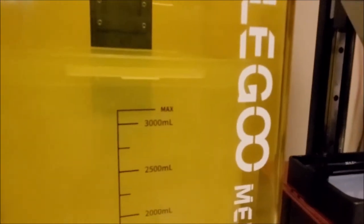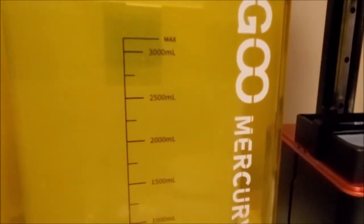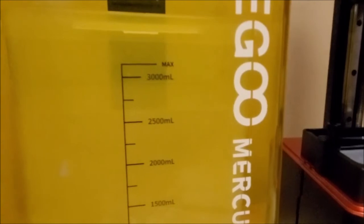So we'll let this drip, and then I gotta run it through this device here, which is an alcohol bath that allows it to rinse the remaining resin off the surface. And then after it goes to the alcohol bath, the same device will also create the UV light that will harden the resin. So it looks like it turned out okay. Yeah, we'll find out. If not, I'll be making some changes to this and probably reorient the item to be printed. Sometimes working it kind of flat like that's not as good as, say, putting it in at an angle.